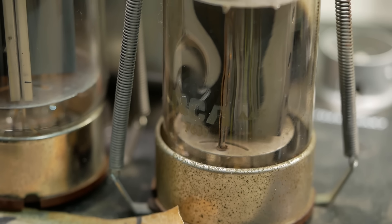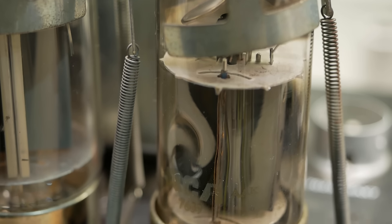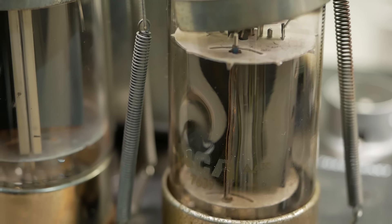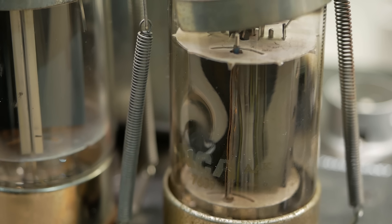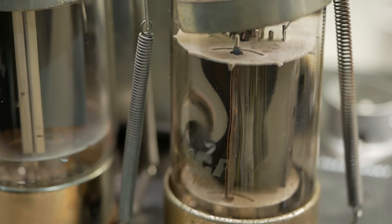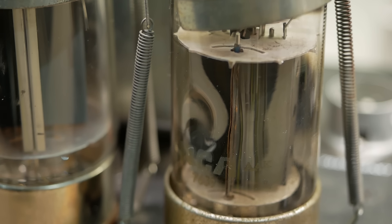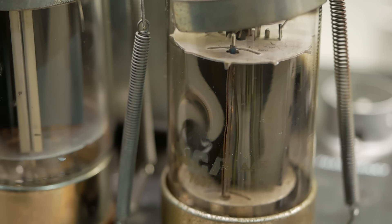I think we've found the source of the smoke. The glass envelope on one valve has gotten so hot that under vacuum that hot spot has been sucked in — the radiant heat off the anode was so hot it actually softened the glass and the vacuum sucked it in. It still hasn't lost vacuum, but I'd say that valve is cooked, or the bias supply is cooked, or both. There's also some tape on there showing which valve switch.